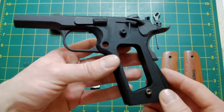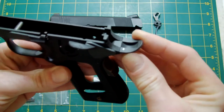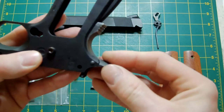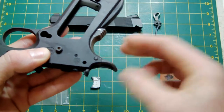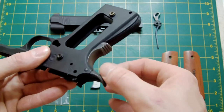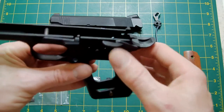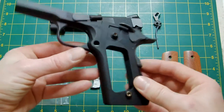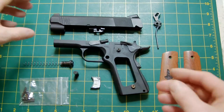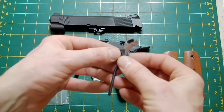The frame itself is a standard 1911 A1 frame — I've ground the tangs down to fit the grip safety, and they're pretty much spot on with no gaps whatsoever. It is still quite stiff, so I've just got to sand the inside of this plastic frame to suit. I'm not going to do it the other way around — plastic frames are cheaper than getting another grip safety. It's been sprayed black but I may do a satin coat yet, as his pistol looks satiny and painted.